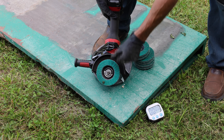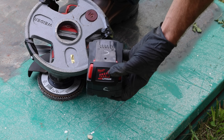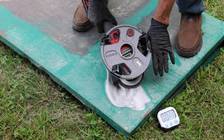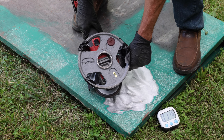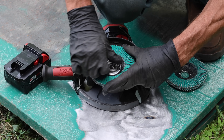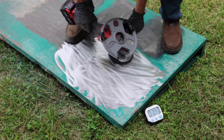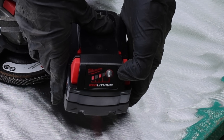This Milwaukee grinder will drain a battery in under 5 minutes. I'll add 5 pounds on top of the angle grinder and replace the flap disc between testing each battery. The counterfeit Milwaukee had just enough power to get the angle grinder going, but it powered down in only 8 seconds. It powered back up but kept shutting down — it shut down 11 times in a minute and 15 seconds before it would no longer power up. The battery was very hot and seemed drained. The genuine Milwaukee battery allowed the grinder to maintain a much higher RPM and lasted 2.5 minutes before the angle grinder powered down — though the battery powered itself down to protect itself rather than being fully drained.